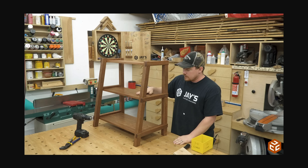I want to pull some design elements from this particular project I made years ago — the Angled Half-Lap Three-Tier Shelf. I'm not going to do the angle on the front simply because I want maximum shelf space as I go up. What I want to pull from here is the proud half-lap joinery. This technically isn't a half-lap; it's more like a 7/16ths lap. You get the strength of a half-lap joint but you have a lot more visual interest because everything is a little bit proud — the end grain sticks out in all directions. If you were to flush up all of this and just make it all nice and flush, it just wouldn't be as visually interesting. So we're going to make everything nice and proud, and come back and chamfer everything.